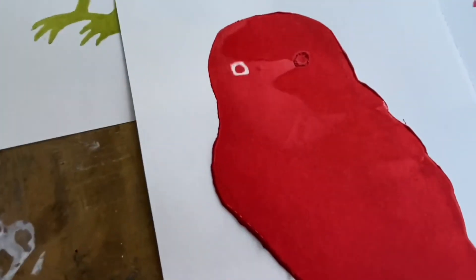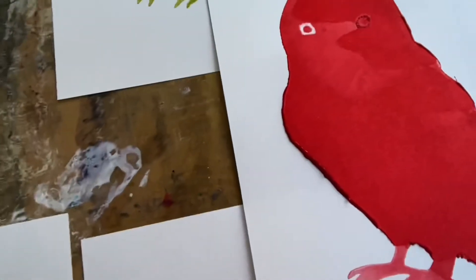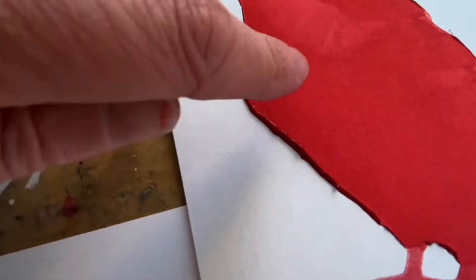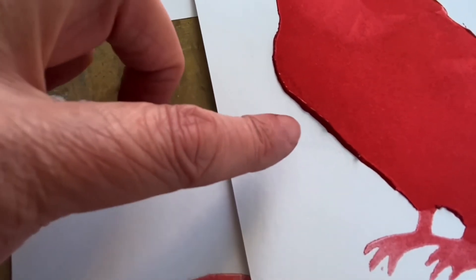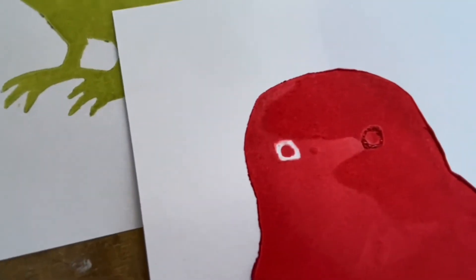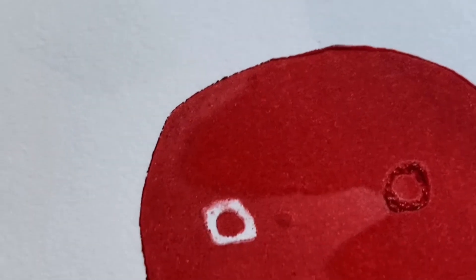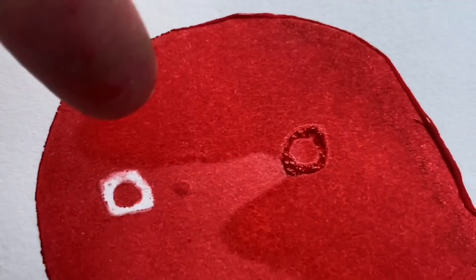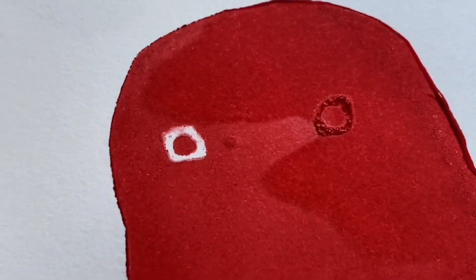If we look at some of the issues: if there's too much ink on the printed surface, you can see what's happened here — it's created a ridge and displaced it along one side. Also there's an issue with this particular one where the ink has filled a cutaway section in the right eye; you can see where the area is now full of ink and has printed as a solid rather than a cutaway section.